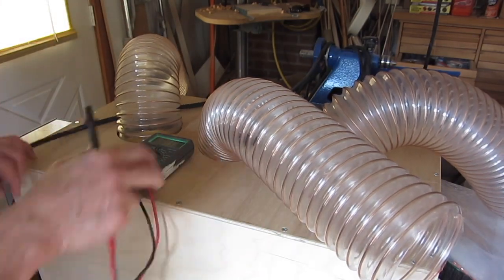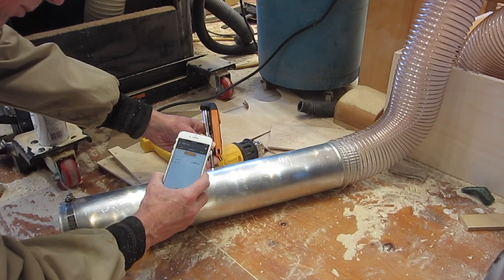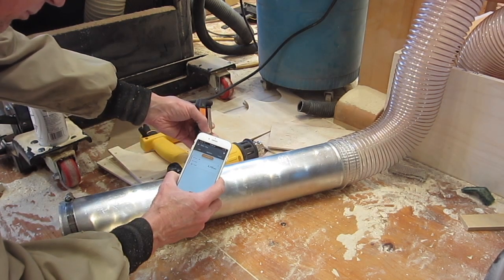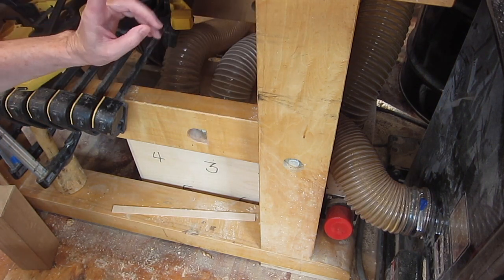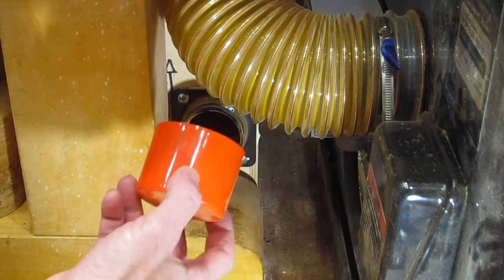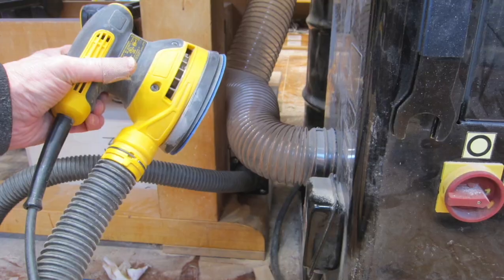This is the top of the manifold box with the five-inch hose from the cyclone on the right, and three four-inch hoses coming off the blast gates going to the tools. Measuring 4,000 feet per minute at the four-inch hose connected to the blast gate — and it may actually be a little better in the final installation because the hose will be cut shorter. I cut holes in the floor with a router using the same template. Three flexible ducts come out the bottom of the manifold, go through holes in the floor, and connect to rigid metal piping. I put a two-and-a-half-inch port on here with no blast gate — just slip a paint can lid over that when it's not being used. I can connect a big hose for cleaning the floor or a small hose for a random orbit sander.